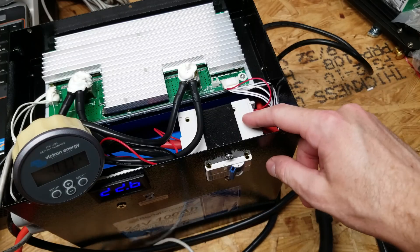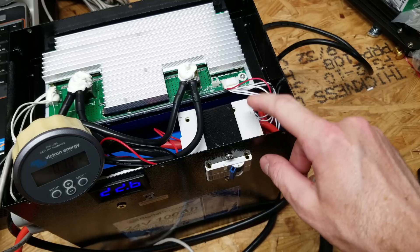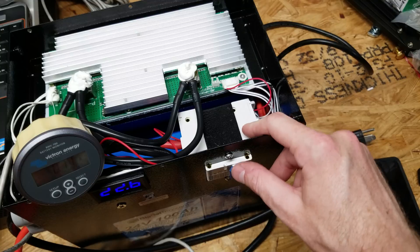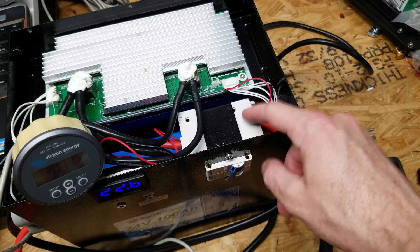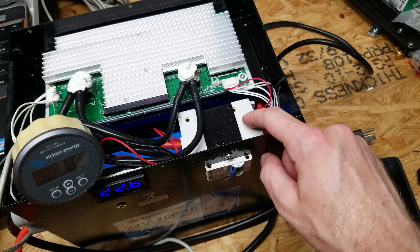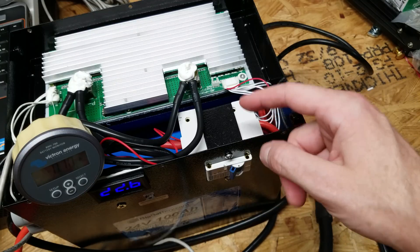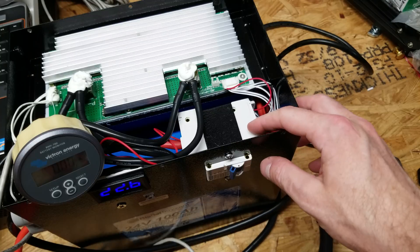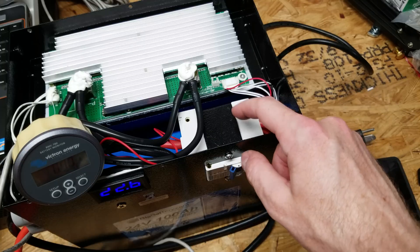This is a 100 amp hour battery and we only consumed 83 amp hours. However, it's important to note that we tested this battery at nearly a 0.9C rating the entire way through, and the manufacturer standard for testing batteries is typically around 0.2C. I have no doubts whatsoever that we would hit this 100 amp hour capacity if we had been testing at the proper 0.2C. Replacing this double pole breaker with a single pole 125 amp breaker significantly reduced the temperature of the breaker itself by more than half — it was testing around 150 degrees Celsius before after only 15 minutes, and even after half an hour it was still around 75 to 76 degrees Celsius. That begs the question of whether the issue was caused by the original breaker or by those bolts being loose.